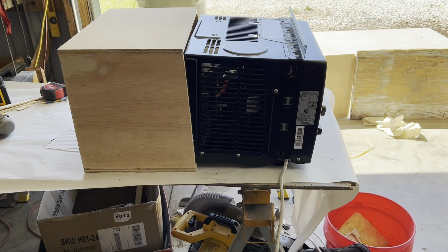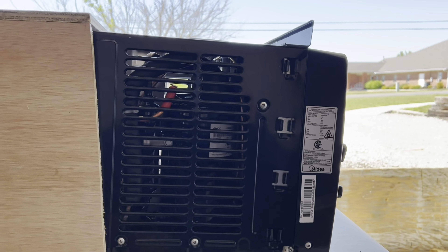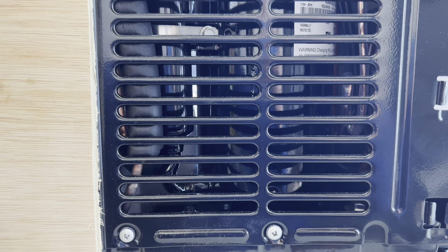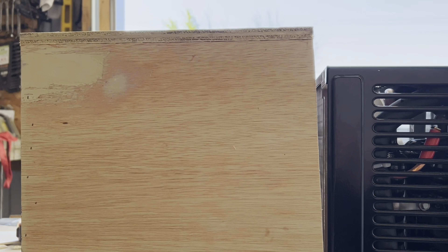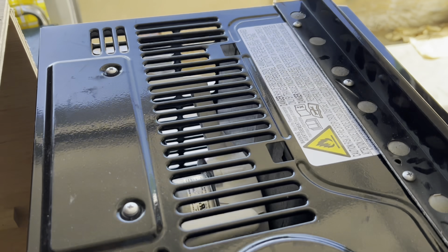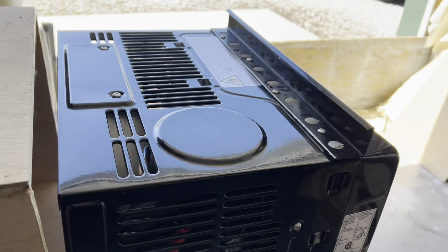What I wanted to show you is it's going to sit in here — this is going to be up higher. I'm just going to ease this in here so you can see we never want to cover our vents. We have about one and a quarter right here that we need to add. So this measurement was 10 inches and this was nine and a half — we added our one and a quarter and came up with about 11 and a half. The main thing is just don't cover your vents. They've got to get fresh air in up here, and by sealing this off like this, the exhaust is forced out the back and it doesn't mix with the fresh air.